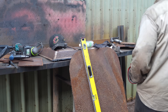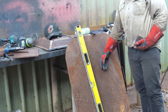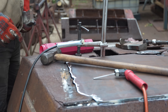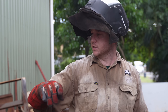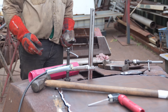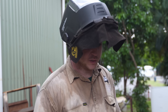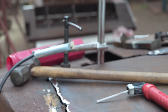This is our top piece — that's the plate we're going to be using. 12mm steel plate. That will get welded on here as the patch. Once that's all in and everything's straight, we can just straighten that piece back up — you can see there are a few cracks in it — and then once it's straight we'll pop that back on, re-weld it on, and then fully weld everything in one big go. I'll go around with a stick welder using 312s and do nice big thick welds all the way around to finish it off.